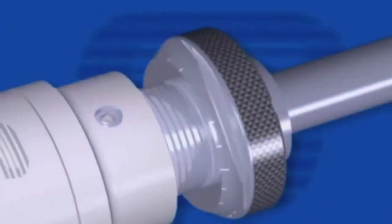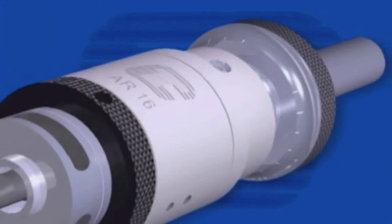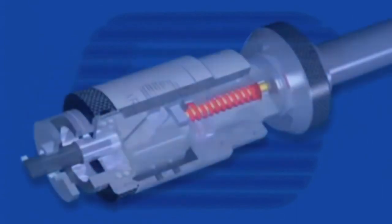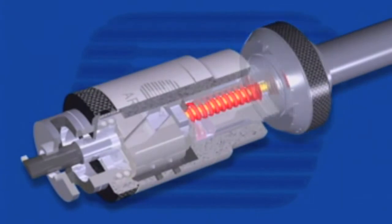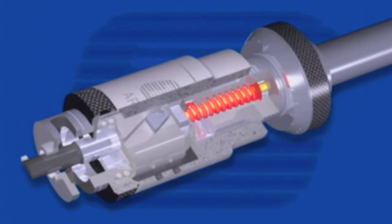The AR-Series recessing tool can be broken down into several basic components including head, pilot, and cutter. Standard heads are available from stock. The head includes the shank and rear body with the micrometer stop attached. The tool body compresses onto the rear body once the pilot comes into contact with the workpiece. The tool slide and slipper assembly actuate the cutter radially.